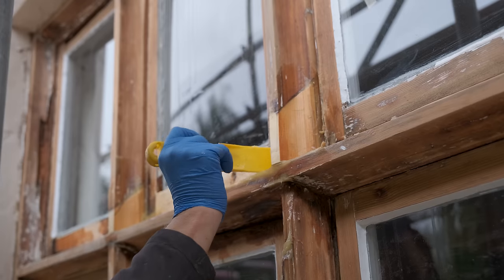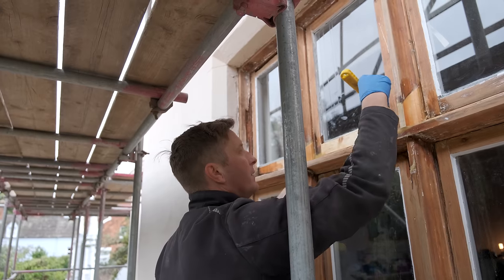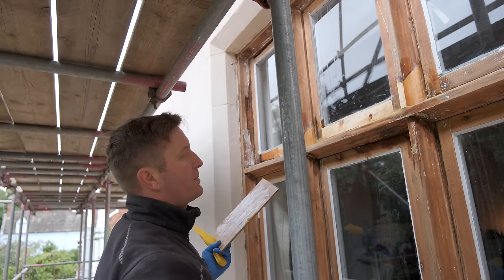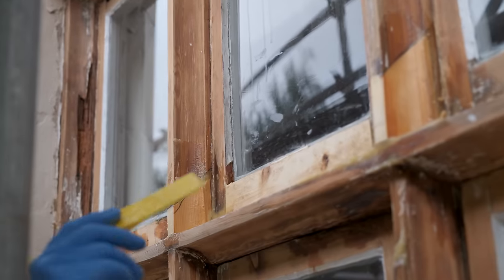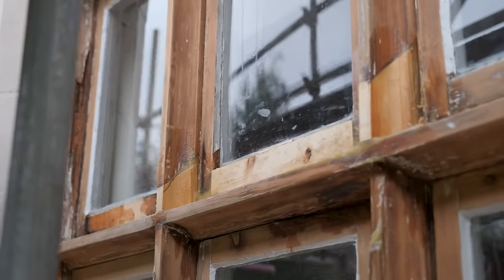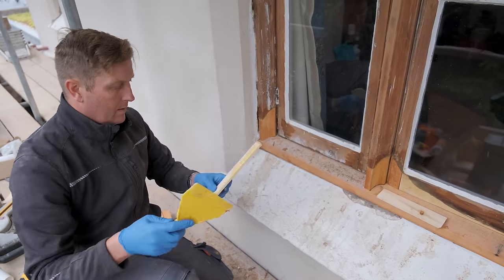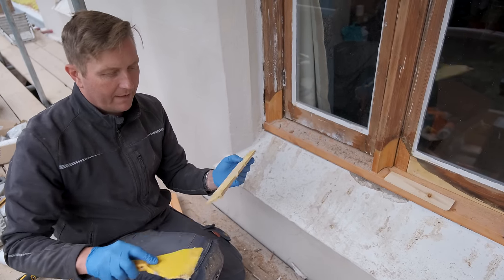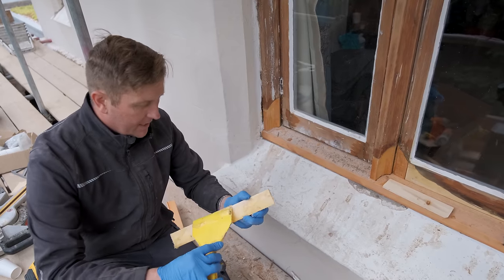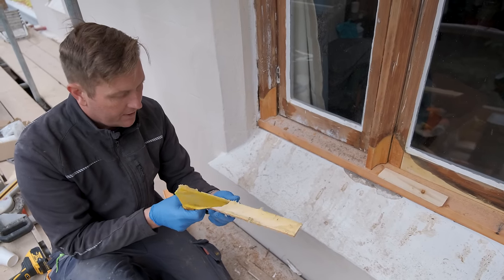This is probably one of the worst windows I've done for rot. This repair will last a very long time, and at least the client knows that — maybe 20 years' time. I've seen new windows go in that don't last 20 years. The only place I do leave things proud is where you've got these mouldings — you can get the channels in. Surface parts are quite easy to blend in with a razor-sharp chisel, but with the grooves they're a nightmare to try and introduce afterwards. I'll try and get those in now. As this is quite a thin, well-cut piece, it's enough to make it stick — it's only really end grain. You need to leave big voids to give it something to stick to. So I like to make sure it's got a good coating all the way across, same as you do for porcelain tiles really.